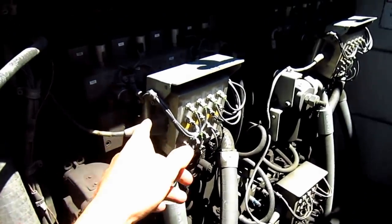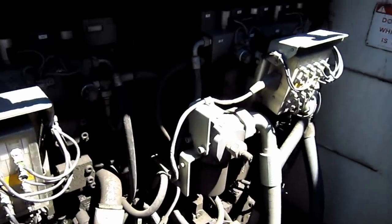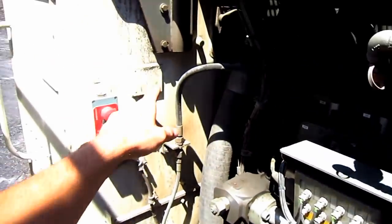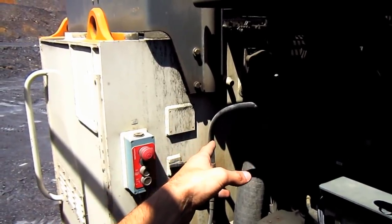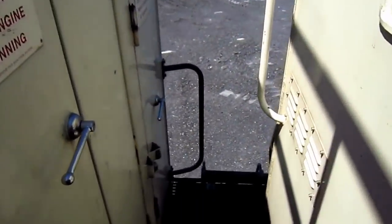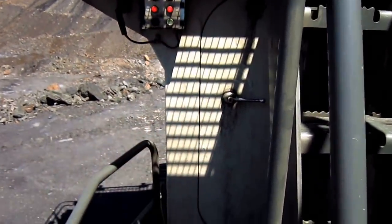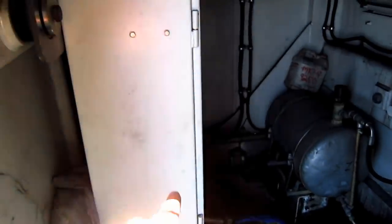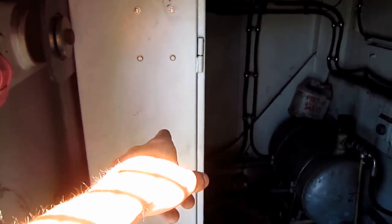From here you can get a good view of the hydraulic system and the control valves on the R9250. On the left side of this machine, located right behind the operator's cab, is the hydraulic oil reservoir tank, which holds 602 gallons of oil. This compartment located directly below the operator's cab is the electronic room, and inside this box mounted on the wall is where all of the computers, relays and electronics are located to work the machine.